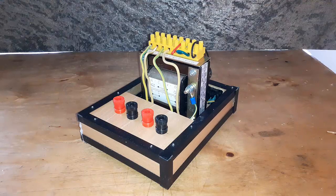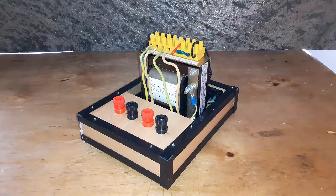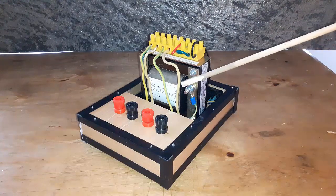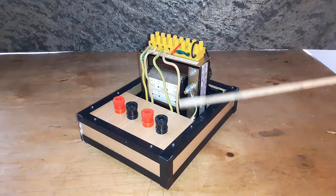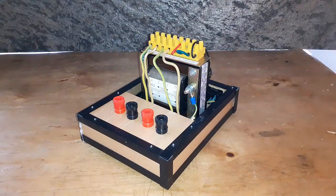Now, this system will work on either 230-volt or 115-volt. You set the input voltage by adding some jumpers. In this case, this system is set up for 230 volts. Again, screw connectors. Over here, there's a ground connection, which grounds the chassis. If you go over to PolandBest.com, you'll see all the specifications on the transformer, and all the safety regulations to which this transformer complies.